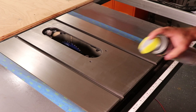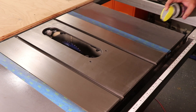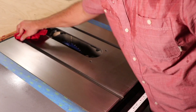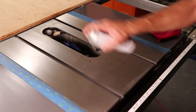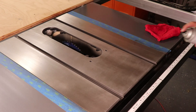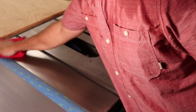With the rust gone, it was time to prep the surfaces with some degreaser. I chose to use a WD-40 version, but any degreaser would probably work here. Wipe it off with a clean rag and let it dry for about 10 minutes. For the table saw surface protective coating, I'm going to use Glide Coat. I've heard really good things, and it should make the surface slick, making cuts that much easier. Using a new clean towel, just wipe off the excess.